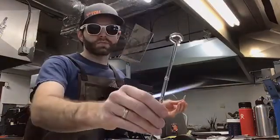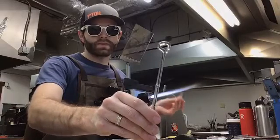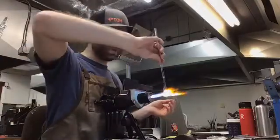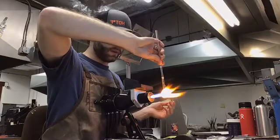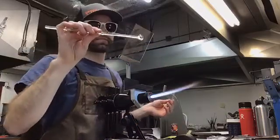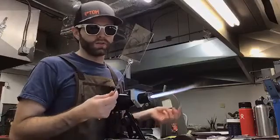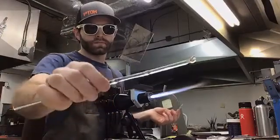And boom. Look how much smaller that little blob is where I disconnected it. That's what happens when you do it right away. Now we'll melt in those acute angles where we joined it, doing one side at a time. Hold it upside down so we're working with gravity. And you'll just watch it flow together. Right about the time you think it's going to get out of control, come on out. That's usually when it gets melted together.